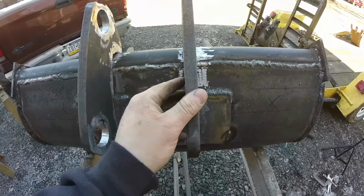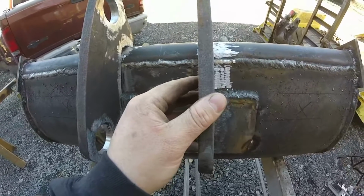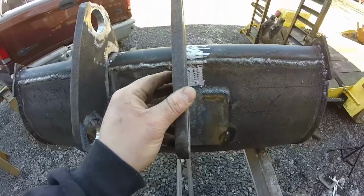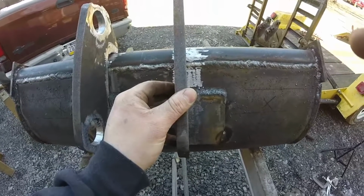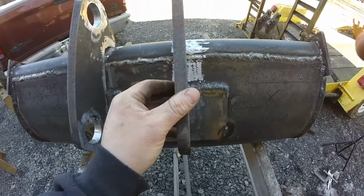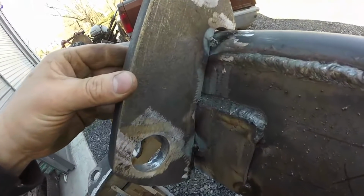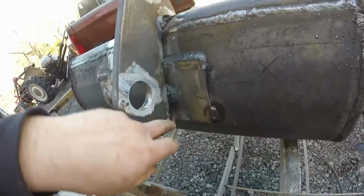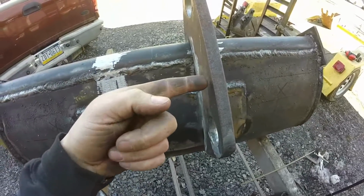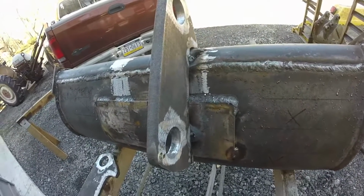and a little trick, you point it inward a little bit, tack the outside, and then you can square it up perfectly when you bang against that tack, and then put a square on whatever and make it nice and square with the bucket. So I tacked both sides, top and bottom. I left this side untacked so that when I bang the ear to the right, it'll stay on those nice strong tacks. You don't want little tacks because it'll just break right off.